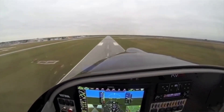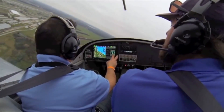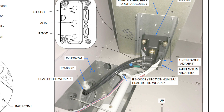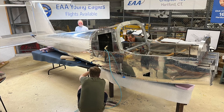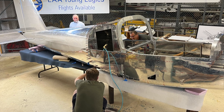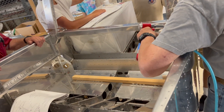Let's talk a little bit about those avionics, which could be helpful for other builders. This airplane is going to have a Garmin G3X Touch single screen, which means there are two critical components that need to go back in the tail section: one is the GMU 11 magnetometer, and the other is the ADAHRS unit. Thankfully those are nicely placed — the components aren't in yet, but the mounts are. They're easy to get to even when the fuselage and tail cone are mounted together, so you really don't need to install those prior to mating — you can do that after.